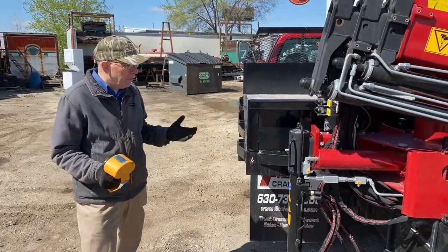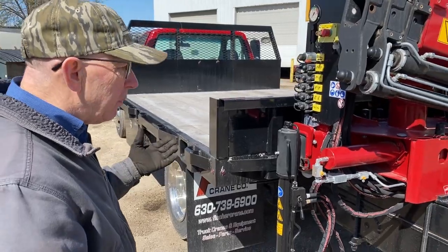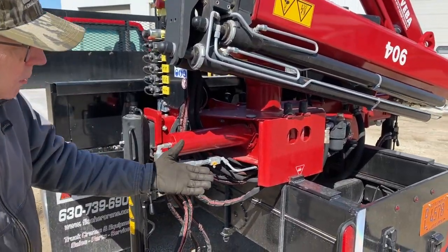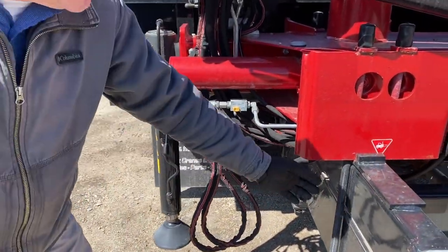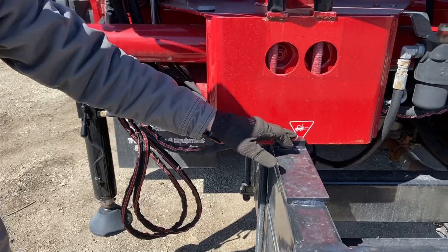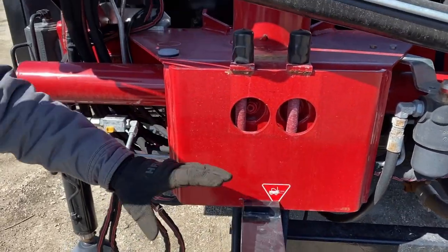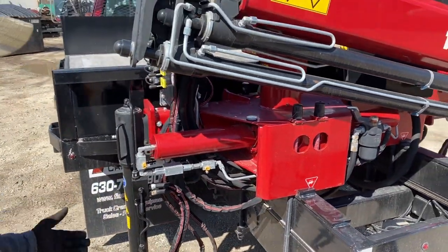Start operation, the first couple of things we want to do is look to make sure everything is in place the way it's supposed to. Very critical that the crane be fastened to its base correctly. Installation was done correctly. You've got a couple indicators here. If things start to move, you'll see the rods get out of line. You'll see them move on the position blocks, start knocking these welds out. As these things start moving, over time, you've got to readjust your mount.